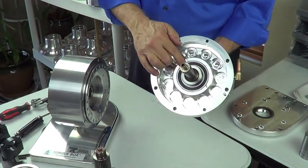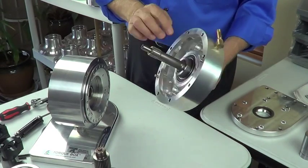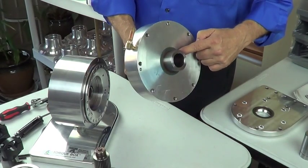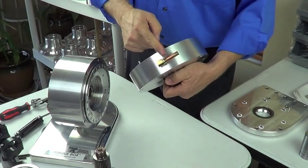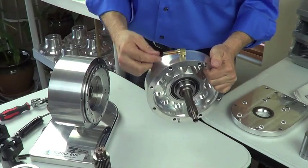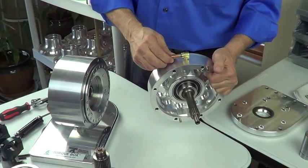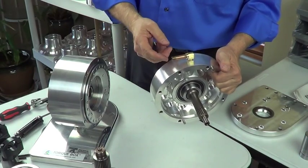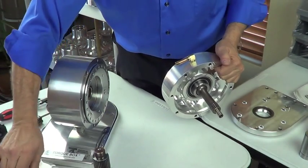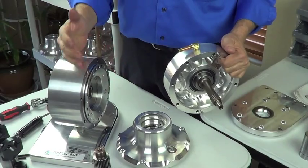The bearing here is a light press into the housing, and the coupler has a spiral lock ring on it. We have a Viton seal on the front side of the coupler. We also have a vent in the top. Typically what we do with this is run a hose up higher, usually underneath the hood to a small reservoir — we can vent through that reservoir or even use it for filling the unit. But we do have to pull the fill plug when we fill the unit, or it won't accept fluid and will be air-locked.